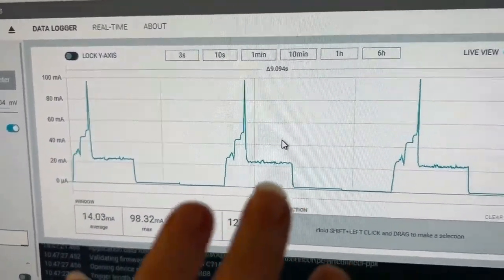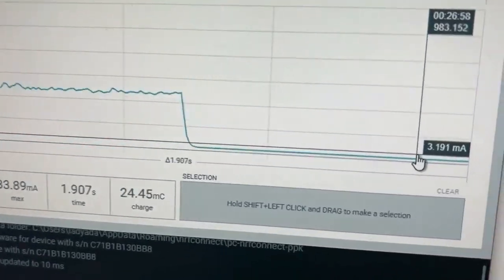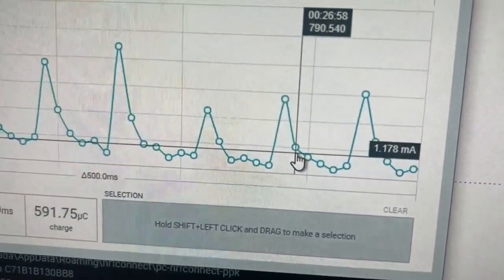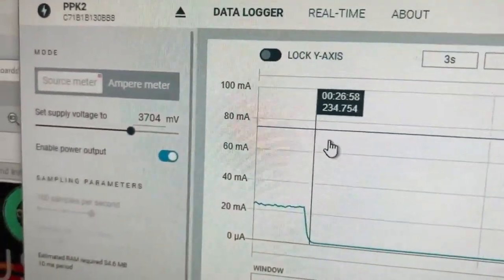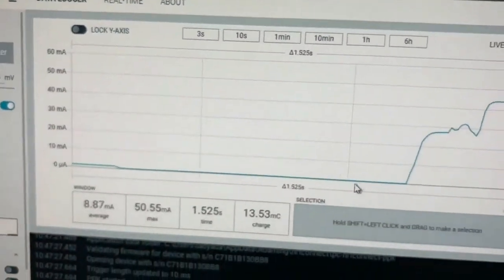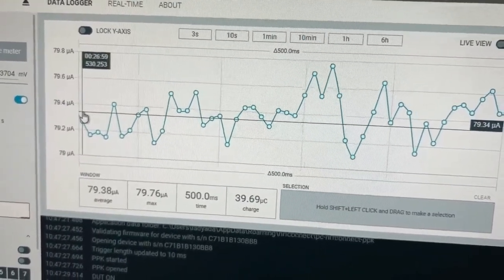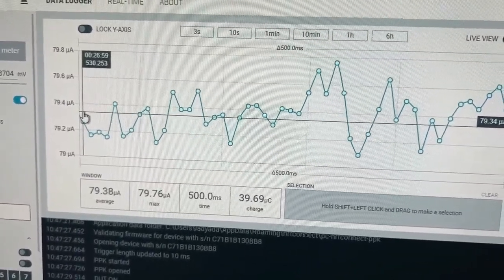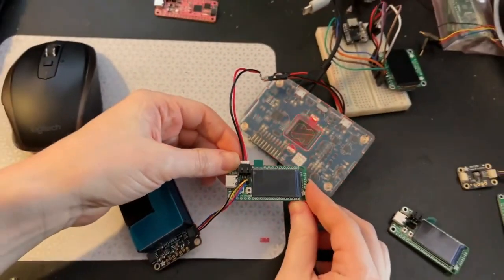Here's my power graph - you can see the big power spike when that PM2.5 sensor turns on. Then this is low sleep mode which is about one milliamp, and then deep sleep mode - let's zoom all the way in - it's about 80 microamps, which is as low as you're gonna get. That actually is the lowest power deep sleep mode you can get on the ESP32-S2. So this is ready to order, be in the store soon.